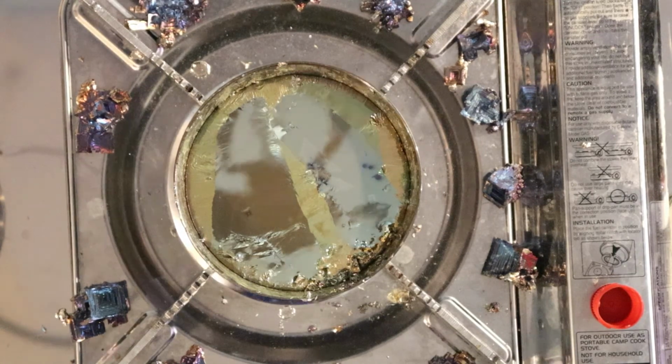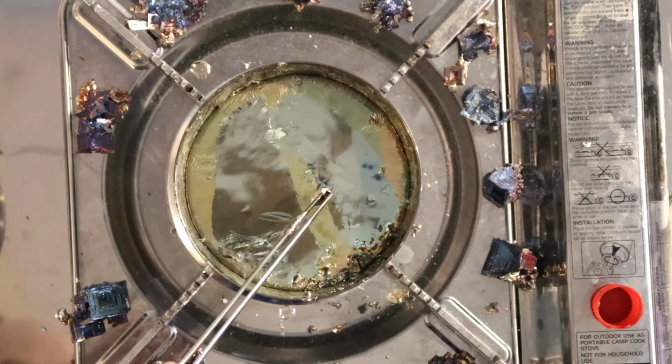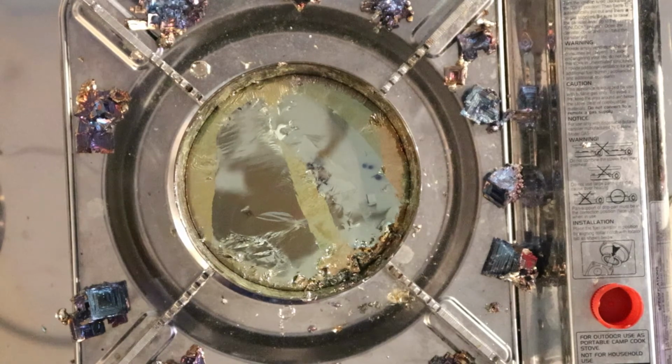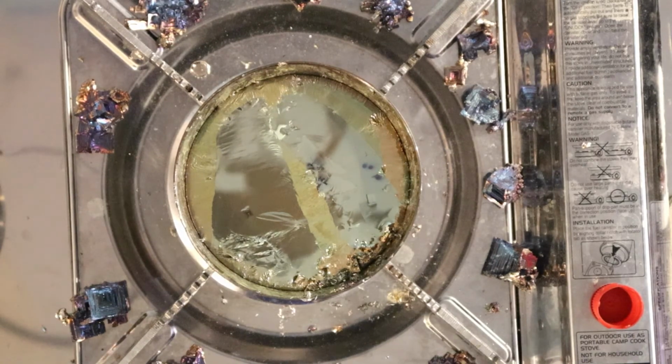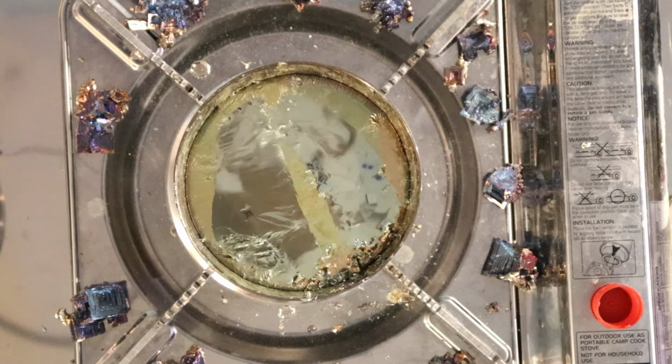Okay, back from a momentary mute. Oh, and yeah, these got this sort of Christmas tree triangle thing going on there. We'll let this keep going for a bit. I'm going to step away from the molten metal quickly and take a water break. Every time I take a water break, I step away from the molten metal because I don't want to get any water in the molten metal. It would just vaporize to steam and spray molten metal everywhere.